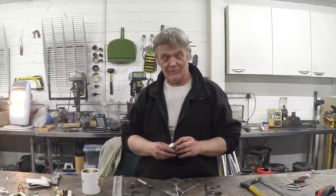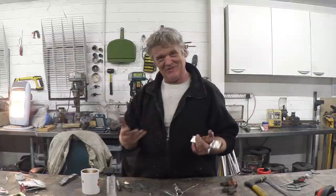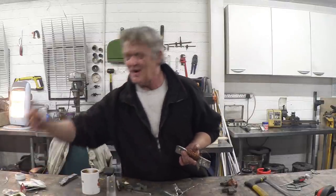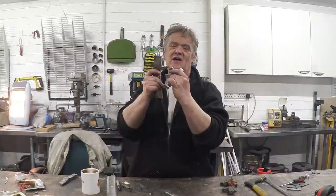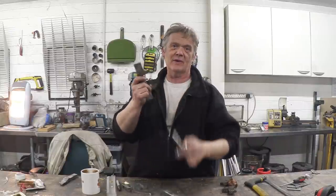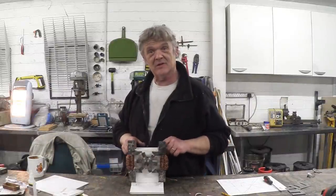Now the armature is finished. It's a little rough because the wire I used was the primary winding out of the microwave oven transformer — that's what I had left — but I wound it from that because I wanted to really use the transformer. That goes in there and spins in there. Now we have to mount it, and that's it set up.